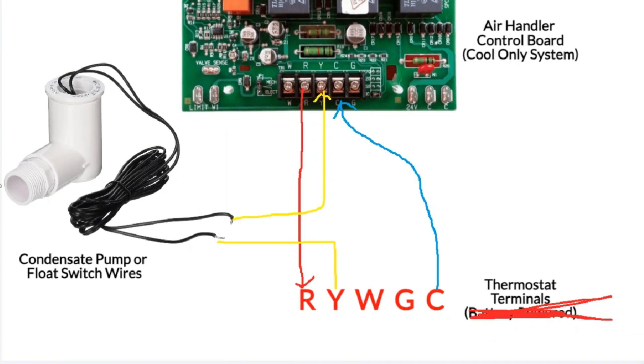Now if you have a smart thermostat without a common wire — like a power-stealing thermostat that charges off of cooling and heating modes — unfortunately there's no way to wire in a safety switch on a condensate pump or float switch that isn't eventually going to kill the battery on the thermostat. Whether you kill the power coming to the thermostat on the R wire or kill it going back on the yellow wire, either way you're not going to have a charging circuit available, and it's unavoidable. But if you do have a common wire, this is the preferred method.